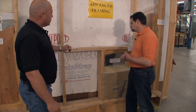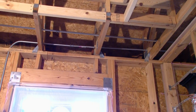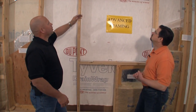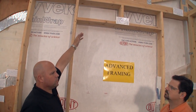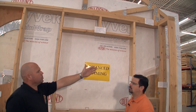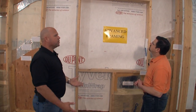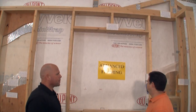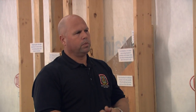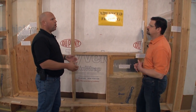Over here, same thing — we have basically less material being used. With advanced framing, we're allowing our headers to be properly sized. Where they used to just be 2x12s put into place, now we're sizing them properly. So this is a 2x6 on its side, which isn't supportive. But with our roof truss going the other direction, our main support would be on this side of the wall. There's no weight bearing on this length of the wall, so rather than putting a header in somewhere where we don't need it, we can fill that cavity with more insulation — giving us a more thermally comfortable building.